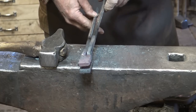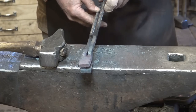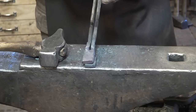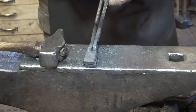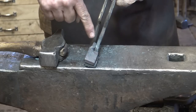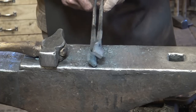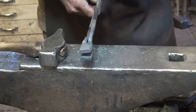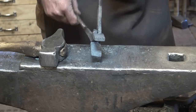You could leave them like this and go ahead and assemble it, but I think I'd rather narrow these jaws out, make them just a little bit longer, and do a few more things before assembling. I think they can be a nicer pair of tongs that way, and it's worth putting the extra time into it. This obvious twist can sort of get in the way — it doesn't hurt anything as long as it's all off to the outside, not to the inside. But if it's got any raised twists on the inside, it'll affect the function of the tongs a little bit.